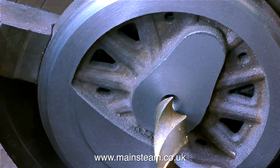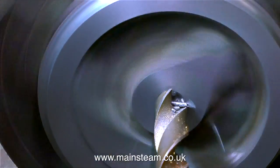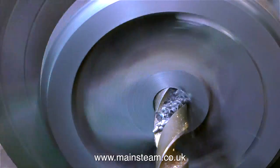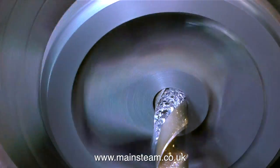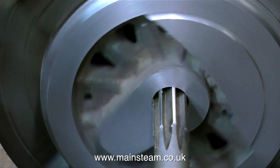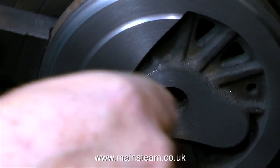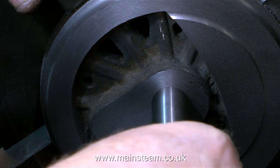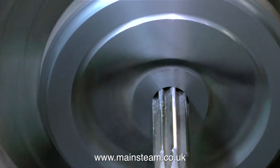The first locomotive wheel I ever made I put it in the chuck with the back side facing out, centre drilled and went through the back of the wheel — and I felt quite smug, I got a really nice neat hole. It fitted the axle, but when I turned the wheel around it wasn't in the middle of the crankweb, so that wheel was scrapped. I made a mental note: machine the back of the wheel but do not drill all the way through. Only drill all the way through once you've machined the back of the wheel, it's back in the four-jaw chuck running true, and then everything will be fine. Here I'm doing just that — centre drilling the front of the wheel, drilling it just under the size I want, and pushing a reamer through to give me an accurately sized hole. To get the size right you need to run the reamer quite slowly; the faster you run the reamer the larger the hole will get.